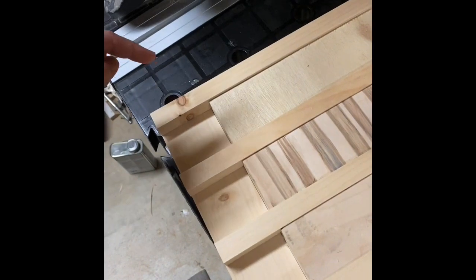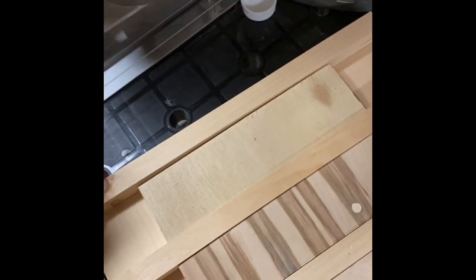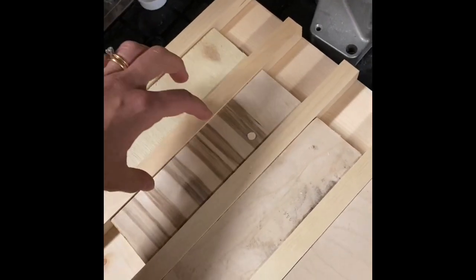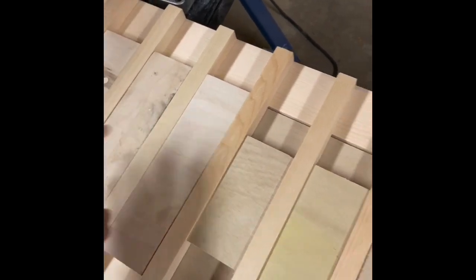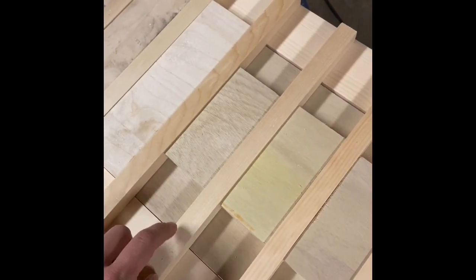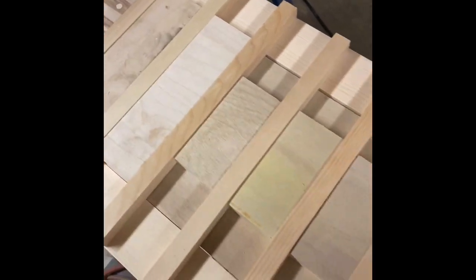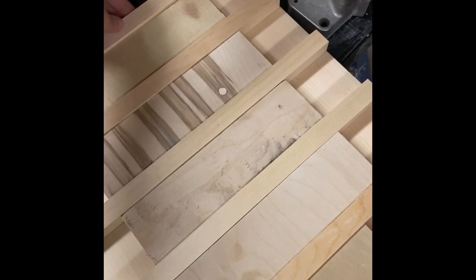The first step is to put two little nails on each side here to make sure this bottom one does not move. Then I'm going to screw in each of these pieces of scrap plywood to make sure that the jig underneath stays sturdy. And then when I'm done I can nail in each of these individual pieces — the three-quarter by three-quarter inch pieces — and then I can just lift the whole thing off as one unit. I can use this jig again for every single one to make sure that they are all exactly the same spacing and it all lines up perfectly.